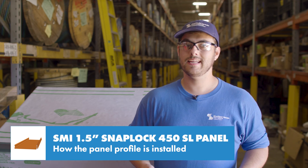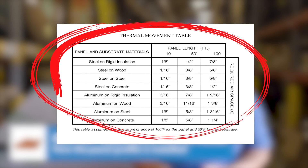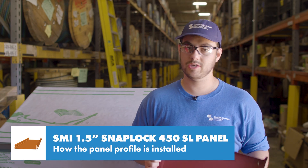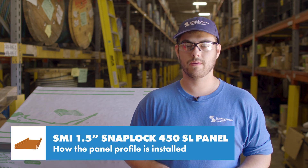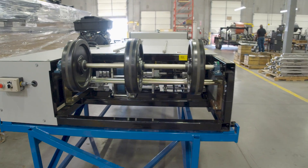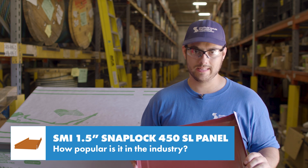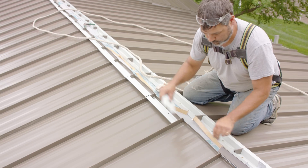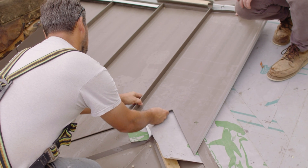The Sheffield Metals installation details has a great thermal movement chart that shows how much of a gap you should leave at the eave based on the panel metal, deck material, and panel length. Details for this profile are available at SheffieldMetals.com and are recommended for both commercial and residential projects. Also, if you run this panel with your New Tech roll forming machine, the same roller kit can run the inch-and-a-half snap lock 450 profile as well. This is a popular profile in the industry and it will look the same as projects that use the inch-and-a-half snap lock 450 panel, so you can use those for reference if you want to see what the snap lock 450 SL panel looks like on a roof.